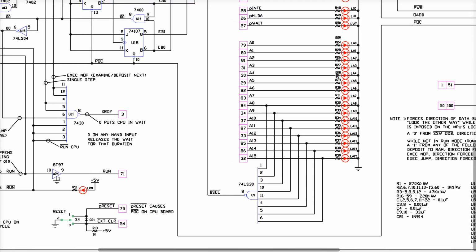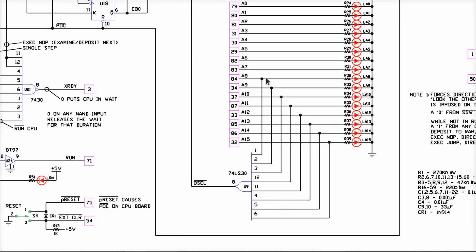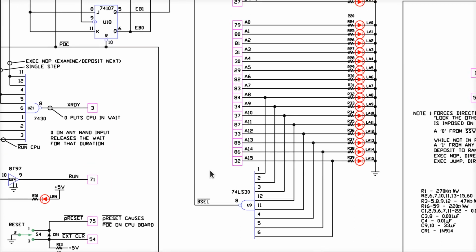What else is going on down here? All these LEDs are the address LEDs. These are all the address bits. You can see them. They're connected to A0 through A15 on the S100 bus. This NAND gate here takes as inputs the entire most significant 8 bits of the address bus, which it uses to determine the I/O port address. And it asserts this signal as true, which is low, so that the card knows when I read or write from port FF, as I showed earlier in another video on my channel. That's the port that if I read from it, I can input the value that's currently on the 8 switches on the front panel of the CPU. I can also do an output operation, and store a value in the 8 LEDs that are also on the front panel.